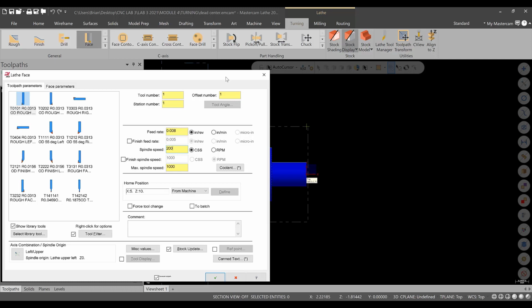We're not looking for optimal speeds and feeds or being super aggressive with this operation, as again, depending on what class you're in, when we go to run this, we just want to make sure that we do it once. We worry about tolerances, make sure it's done accurately. I'm not necessarily worried about being super efficient with your speeds and feeds. I just don't want the part getting thrown out of the machine if you make a mistake with your depth of cuts and things like that.